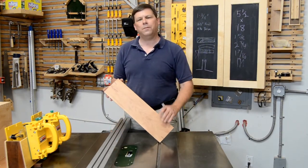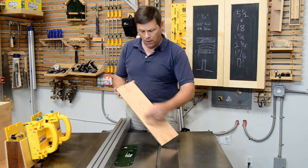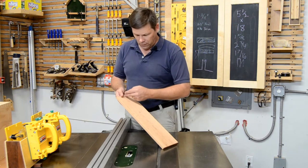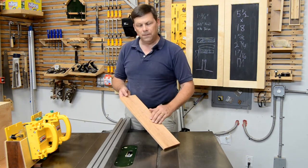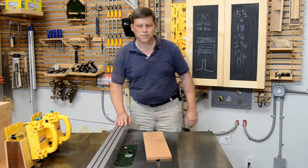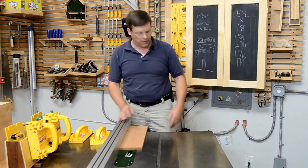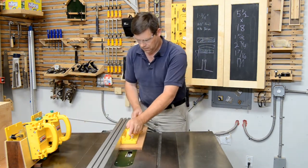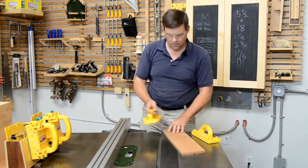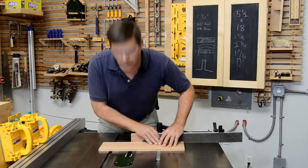Here I've got a piece of stock — it could be a post, it could be a rail, it could be just a flat piece, whatever. I want to put a V groove right down the middle, another one 90 degrees to it crossing it, and then two more at 30 degree angles. Obviously the groove down the center could be done with a router bit, and I could do the 90 and the other ones using a miter gauge, but it becomes difficult. Here it becomes simplicity itself. First we set up the rip fence and we're going to make the slot right down the center — we're not removing a lot of material here, so it's a pretty easy cut. Now I can set up my miter gauge; I've got a mark where I want that cut to start and I can come in and make my 90.